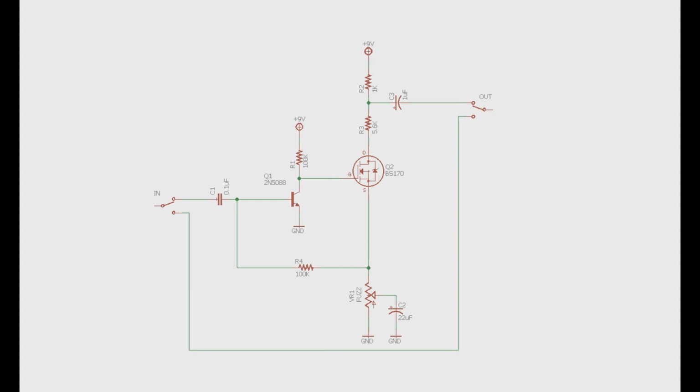If you have the pedal disengaged, you can measure the input and output lines with a voltmeter and see if there are any voltages lingering at the ends. What you're looking for is if you're getting tens or hundreds of millivolts at the ends of your circuit. To resolve this, typically people install anti-pop or bleeder resistors at either end of their pedal that takes those lines to ground, allowing this built-up voltage a place to bleed away to.